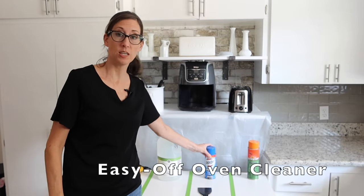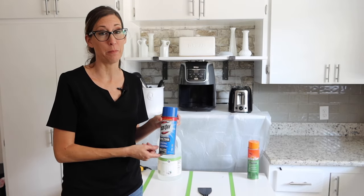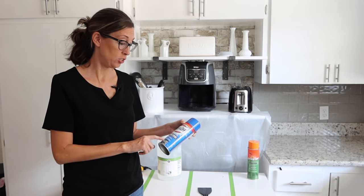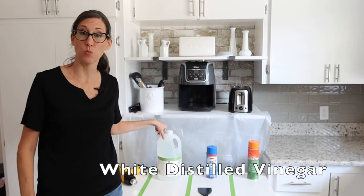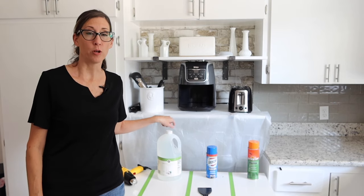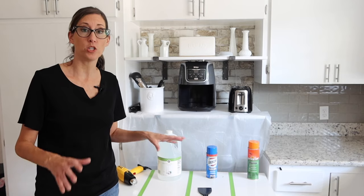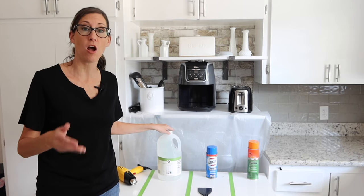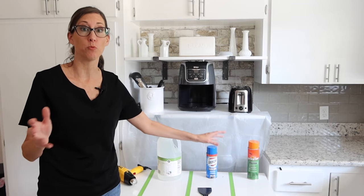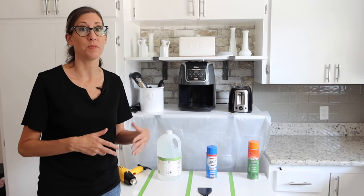The second one is something I haven't used before — oven cleaner called Easy Off. I've seen a lot of bloggers use it with a lot of success. It's a fume-free household item. The third is white distilled vinegar. I've tried this in the past without a lot of success, but I'm going to try it again with some tips I read online. The vinegar isn't going to remove the paint — it should just soften it so you can scrape it off, whereas the paint stripper will actually remove the paint. The Easy Off I'm assuming does something similar to the stripper.